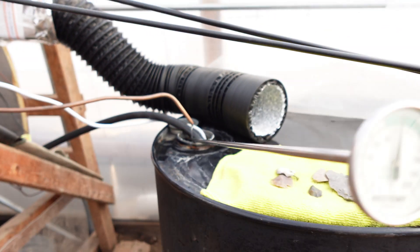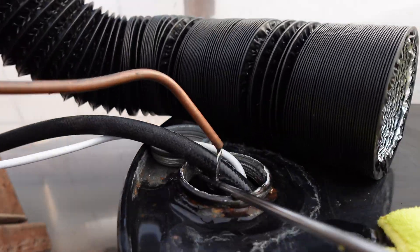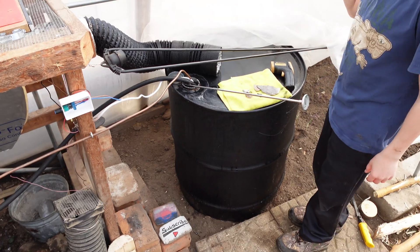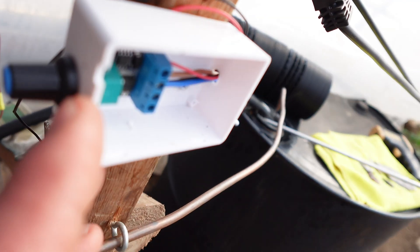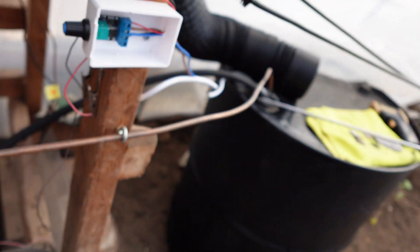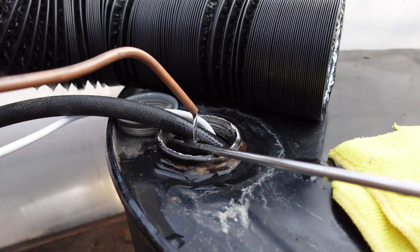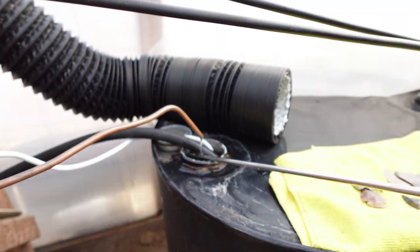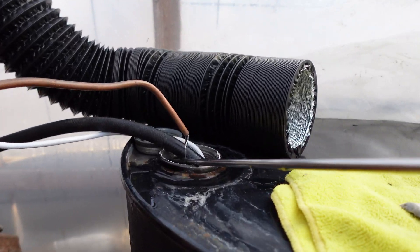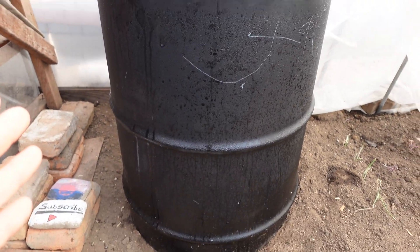It's not much there and we're holding just about 100 degrees — about 99. So for a flow rate of slightly under a gallon a minute, I have put a couple dots on here to mark the setting. On the back side, we've got a dot that I turn it to when we've got decent sunlight as the sun is breaking through the clouds, so we can transfer about a gallon per minute to the tank. With a transfer rate of about a gallon a minute, we're looking at about 55 minutes to transfer 55 gallons.